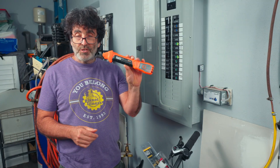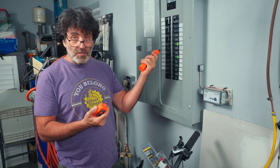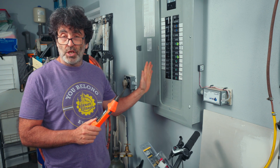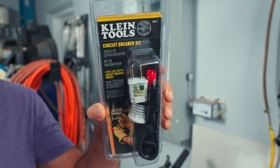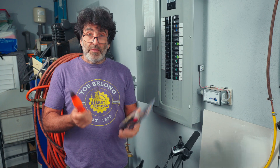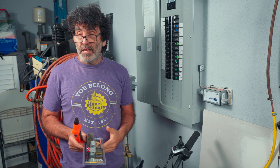What I'm talking about is the Klein Tools ET310 Circuit Breaker Finder. It comes with a transmitter and receiver — these two separate. One goes in the house, the other stays out at your panel box. This works very well whether you've got arc fault GFCI combination breakers or conventional breakers. It does not work on double pole 240 breakers though. If you get the kit — it's only five dollars more — it'll allow you to find light fixtures or junction boxes in your attic that you don't know which breaker they go to, so you can tap into them and cut the power without a half-hour ritual of figuring it out.